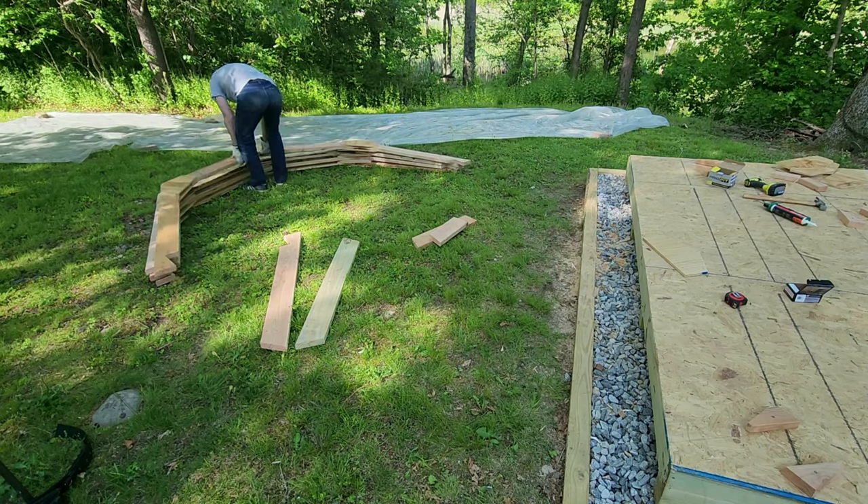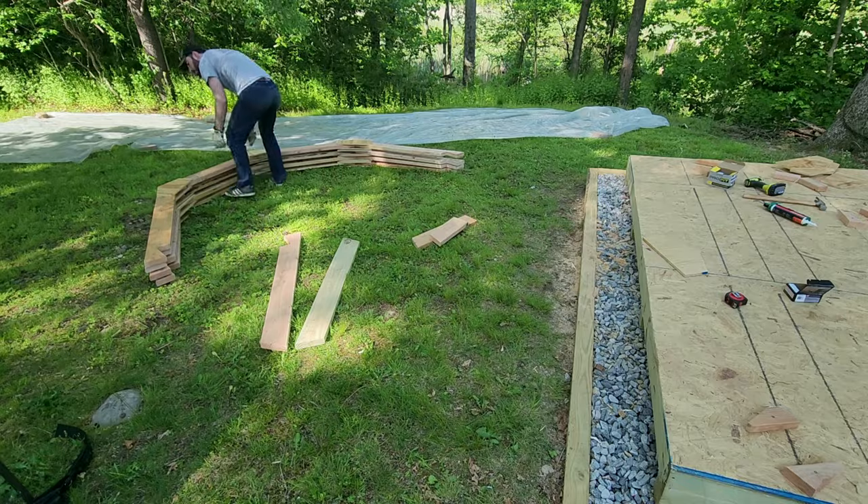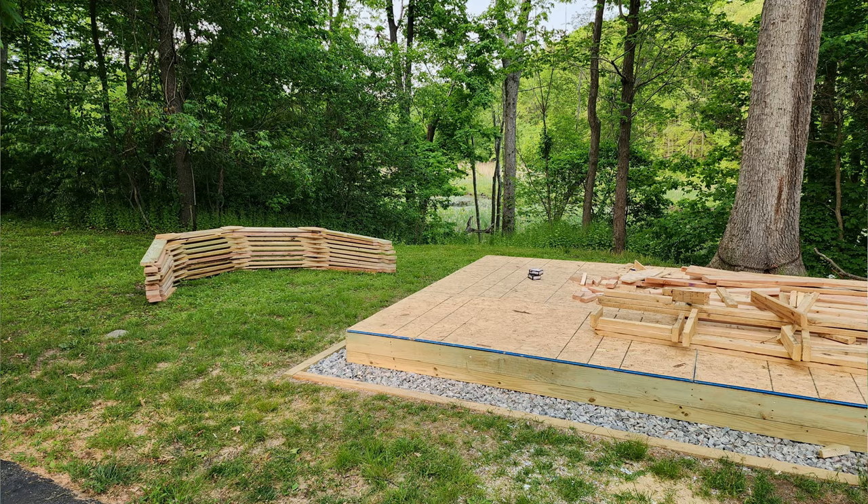So that's it for how to build the trusses. It actually started raining before I finished the video, but these aren't going to be used for a while — you don't install the trusses until the walls are framed out. So set them to the side, keep them level so they don't get warped or damaged, and put a tarp over them to protect them from the rain. If you have any comments or thoughts on how I made my trusses, please leave them in the comments below. In the next video I'm going to start framing the walls, so please subscribe if you want to see that. Please like the video if you liked it — until next time, I'm Carl, and I'll see ya.